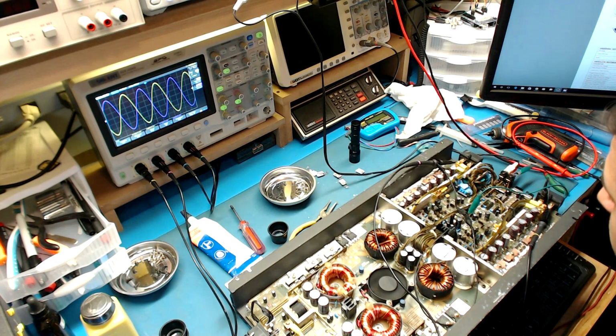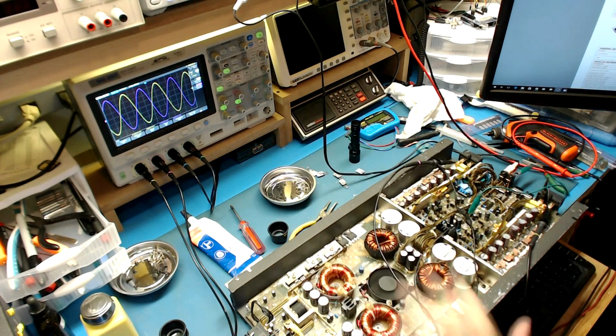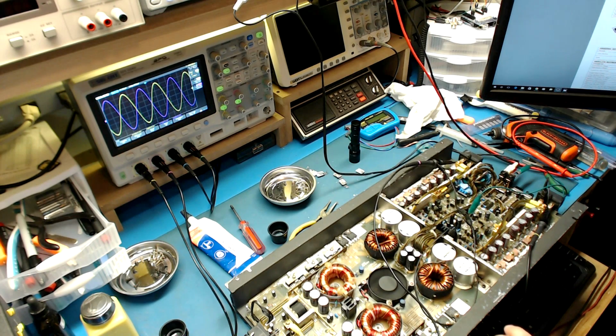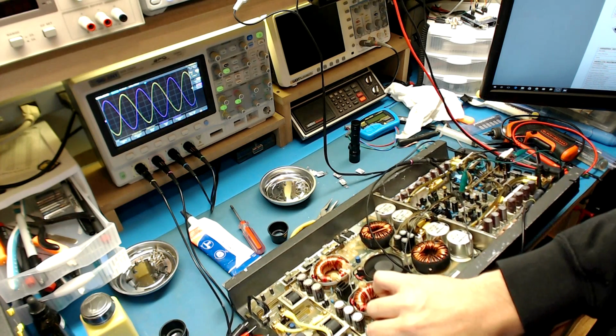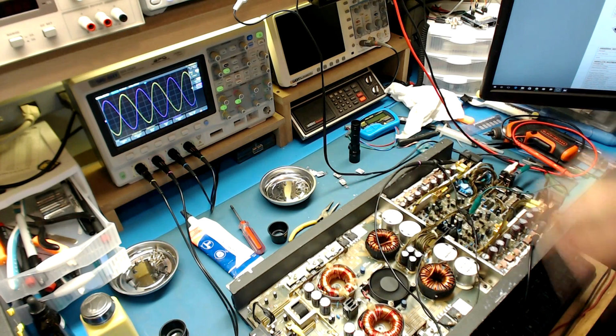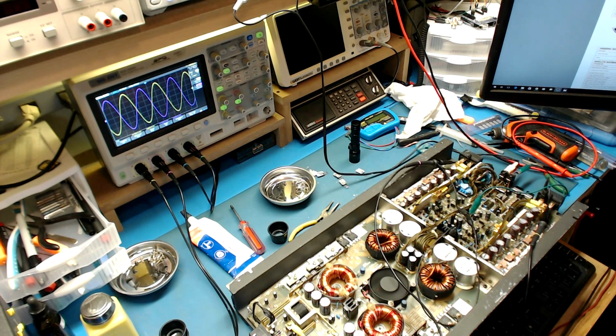So yeah, I'm happy with the outcome so far. At least we're getting signal. That's the most important thing. The rest is just kind of cosmetic stuff. So I'll have to verify the 10-volt low and, like I said, the music signal, and see what we can do about that. I'm going to have to look through the manual again just to verify that I am correct, to make sure before I dig any deeper. But yep, I think we're good here. Before we go on to any real testing, I want to get that taken care of and have these heat sinks re-greased underneath where the boards connect to the heat sink, and fasten everything down and give it a good run up.